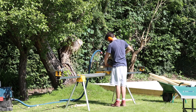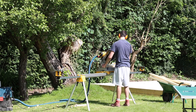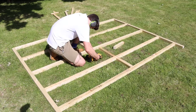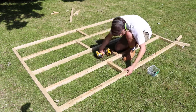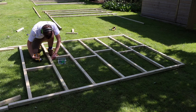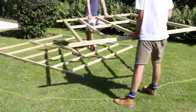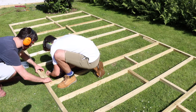The main framework of this shed was made from 2x2 treated pine. This build doesn't necessarily need to be treated pine because I am covering it with plywood and then cladding, so it's not really going to be exposed to the elements — but better safe than sorry. I'm glad I did get treated pine because it did rain at one point before I put the plywood and the cladding on, so if it wasn't treated, that might have caused some issues.